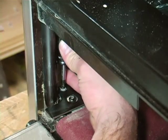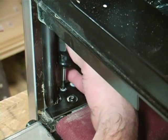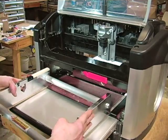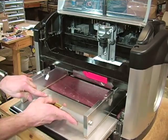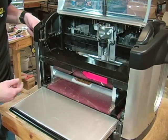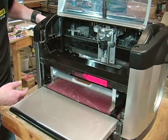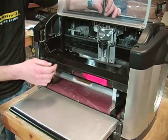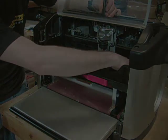Make sure to tighten the front squaring plate screw after adjustments are made. Also, reinsert the jig to verify the plate is now square. Repeat these steps until the jig is square. After precisely squaring the machine to the jig, the system is ready to use.